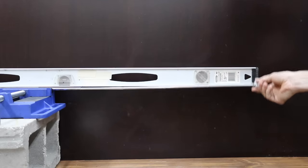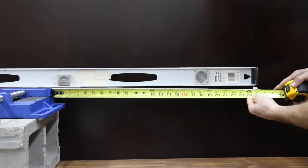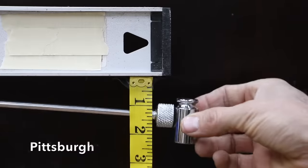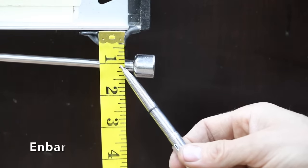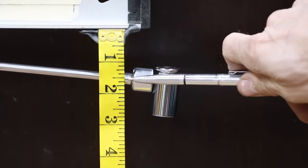If you're trying to retrieve a runaway nut or bolt through a metal-filled obstacle course, a wobbly tool can add to the challenge. At close to 24 inches from the vise, the tip of the Pittsburgh magnet is drooping about 1 and 3/16 inches — quite a bit of sag. Adding 100 grams, the Pittsburgh sagged to 2.75 inches. The N-Bar performed better at 1⅛ inch; with 100 grams it sagged 1 and 9/16 inches, over an inch better than the Pittsburgh.